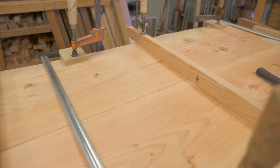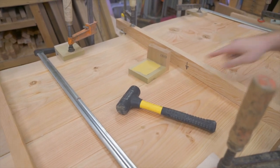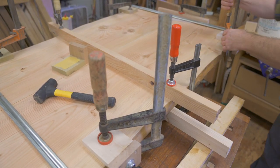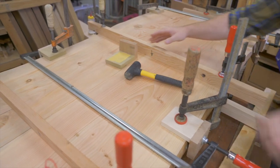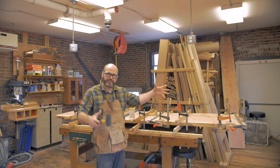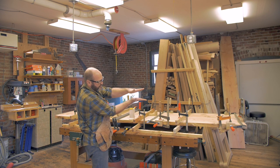See how this is still not flat? That's where these clamping culls come in. I come here with a convincer — see how half of that gap is now gone. I don't have to perfect it, I just have to make it better. Once I knock that down a little bit, I come back to these clamps and start closing down the pressure on the cull. Now that I'm starting to pull this whole thing together, that's where the radius on the culls is really showing its benefit — all these gaps are starting to disappear. The more pressure I put here, these culls with opposite-faced radiuses get pulled flat, allowing this small clamp to reach out and put downward force in the middle of this very wide slab — well over 30 inches wide, probably 36.